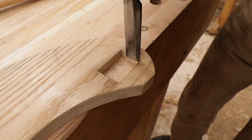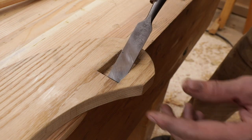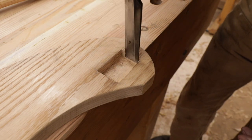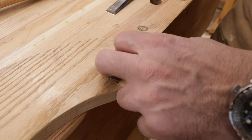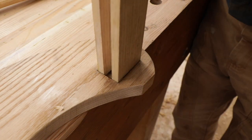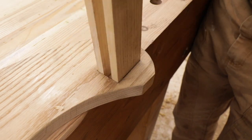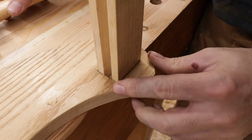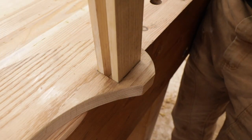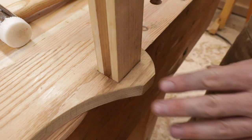You don't actually need the hand router — you can do everything with the chisel, just take your time. Before you do too much trimming, make sure you get all those little shavings and flakes out of there. Always try your tenon in there and make sure — if you're on the margins you don't want to take out material if that little bit is going to help keep it tight. That's nice and tight. That's really good. I'm real happy with that.